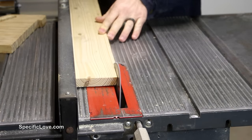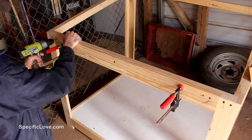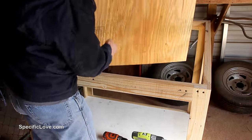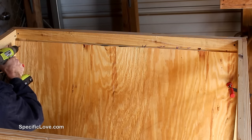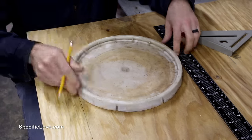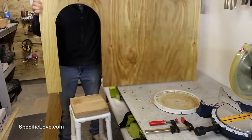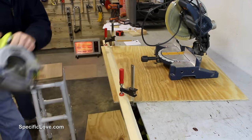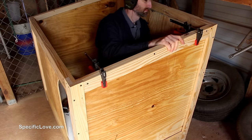It was now time to add the outside frame pieces to the front and back, which meant I had to again take it to the table saw for some angled cuts. I then clamped them and screwed them securely in place. To build the walls I used some thin cheap plywood purchased in 4x8 sheets. I first started with the rear wall because it was a simple rectangle and would let me see how square the total structure was built. I then laid it in place with a small shim underneath to lift it off the floor in case any water or residue existed in the future. I next cut out the front wall which needed to have a large archway for the dog to pass through easily, using a carpenter square, a bucket lid, and my jigsaw. I then secured it in place. The side walls had to have an angle cut on the top to fit, which was done by measuring out each corner and clamping a guide board in place to use a circular saw. I then clamped and screwed each of them in place.